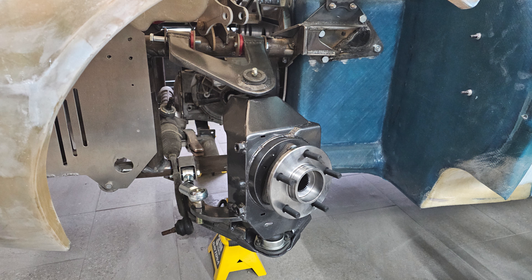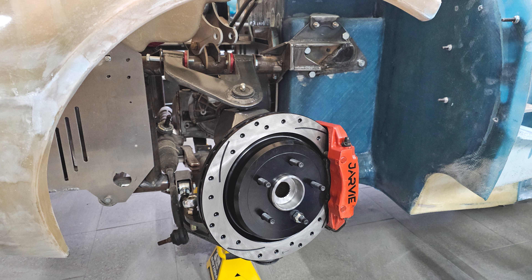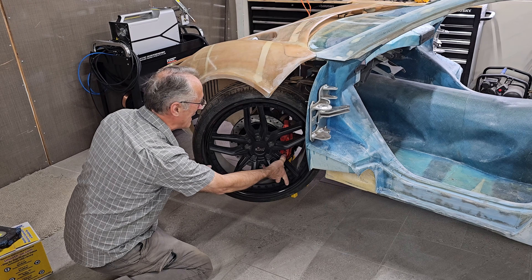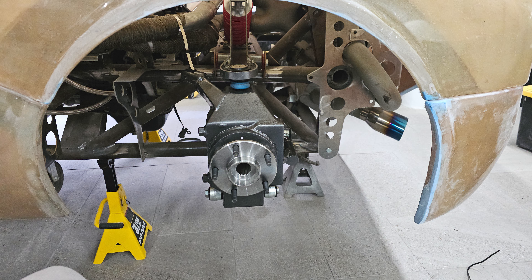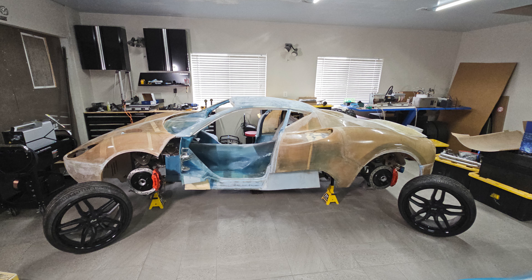Here it is — the hub by itself. Throw the bearing on that flat surface we were talking about, throw our rotors on and our brake calipers — front is ready. The wheel is bolted on permanently, and we've got some good rotation in the steering. Then move it into the rear, swing it up, put the top ball joint in, put the bearing on that one, throw the rotor and caliper on there — and it's ready to go as well. And there it is — the whole unit, the suspension is all ready to go.